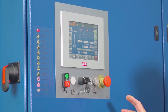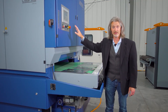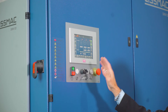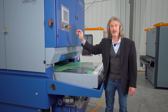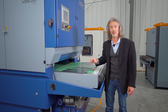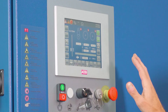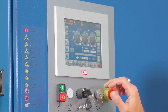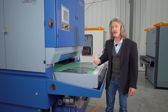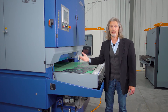One of the key features of the SMW 5 Series machine is the touchscreen control. It's laid out very simply and intuitively. You can control all of the parameters for your abrasive belt head and your brush heads — whether it's a top brush or a barrel brush. You can tell it how fast you want it to go, how deep you want it to go into the part, and which direction you want to go. We try to keep as much of that on the front page as possible so you're not scrolling through page after page. We also have amp meters available on the front so you can easily see, as a part is being processed, how much pressure you're putting on the part and how much unit grinding pressure we have on the surface. You can also keep track of your hours of use and maintenance on this control.